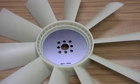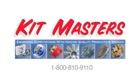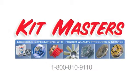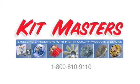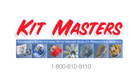Some fans might have 2 bolt circles. If so, measure both bolt circles along with the sizes of the holes, as they usually differ from each other. Now that you have all the necessary measurements, contact Kitmasters at 1-800-810-9110 to find your fan blade number.